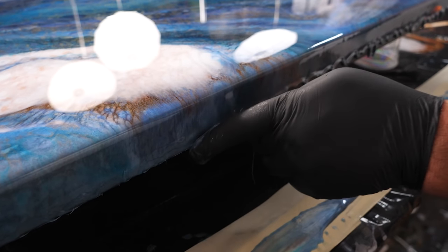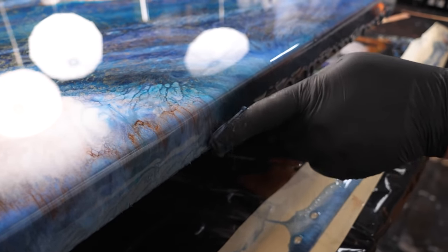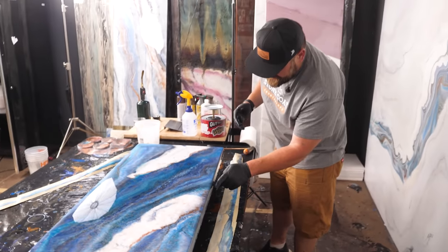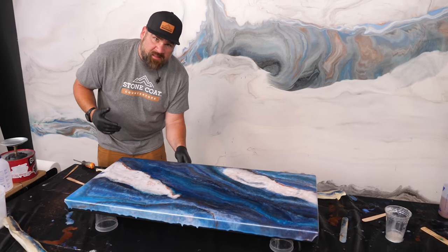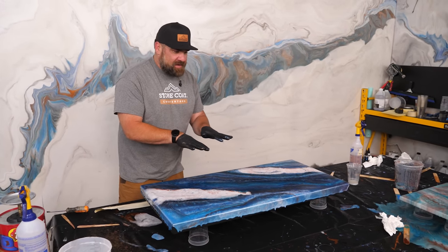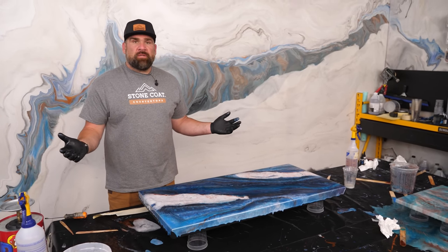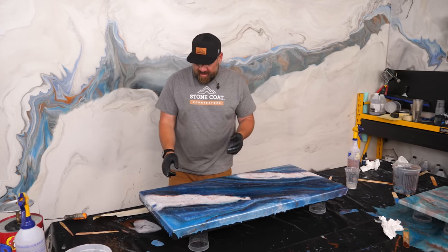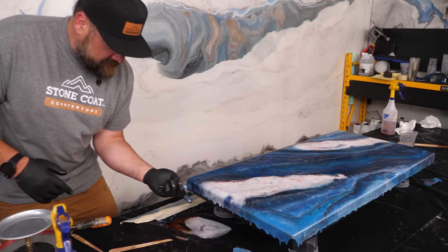All our pretty techniques are going to stay nice and tight because the epoxy has thickened way up — it's really thick, quite gelled up, it's not going to stretch. This is exactly why we do the tape dams, and this is why you need the excess material — this is why you need five ounces per square foot. Because if you only had three ounces per square foot — a clear coat amount — and you taped and peeled the edges, you don't have this mass to push over and coat your edges. People ask why their edges look bad even though they taped. The problem is: do not tape edges on a clear coat when you're using three ounces per square foot.